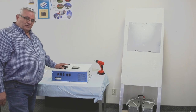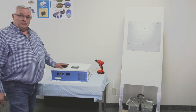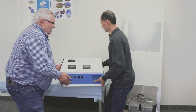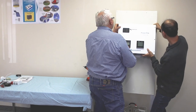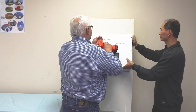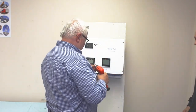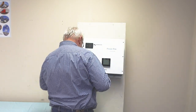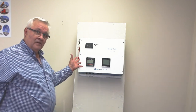The PowerPack installation is a very simplified process. It's basically hanging the box on the backing board and then connecting it. We have a helper to hang the box as it is fairly heavy. There are two clips on the bottom of the backing board that we drop in place, and screws in the top of the backing board for mounting purposes. You put some screws in the back of the board and the unit is mounted.